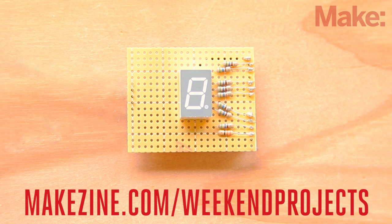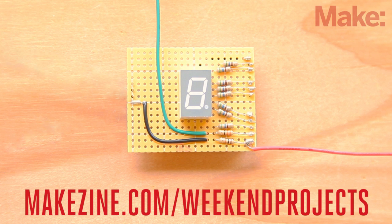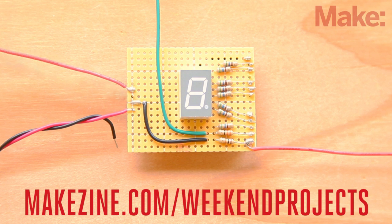Connect the header for pin three on the Arduino to the 33 ohm resistor and then to a piece of wire which will feed the infrared LEDs. The header for pin two is connected to a 10 kilohm resistor, which is then connected to an open ground pin on the other side of the board via hookup wire. Pin two is also soldered to a piece of hookup wire which will connect it to the push button. Next, solder the positive end of the battery connector to the header for the Arduino's voltage input. Then cut and strip a piece of hookup wire and solder it to the header for the Arduino's 5 volt pin. This wire will eventually connect to the other side of the push button. Cut and strip a final piece of wire and solder it to the header for the remaining ground pin.